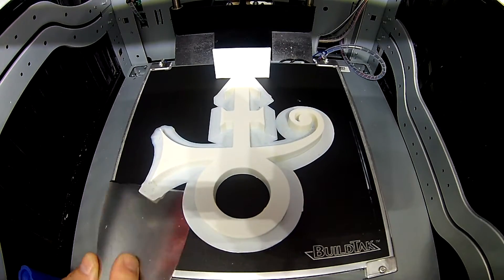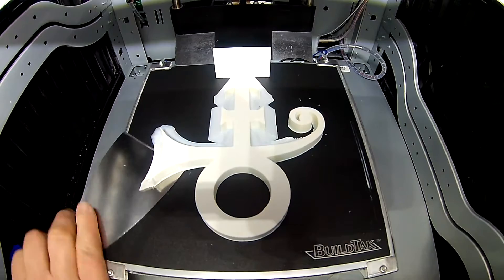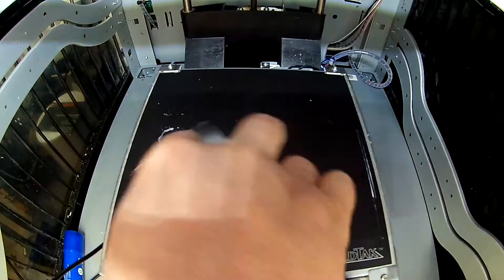It came out very very good — I'd never seen a print stick that much to the print bed. The next morning when the print was done I tried to remove it — that didn't happen easily at all. I learned that when printing on BuildTak you have to raise your nozzle a little bit higher, because if you don't it sticks so well to the print bed that you can even ruin your BuildTak. But when I did get it off, the surface on the bottom side was completely smooth — I've never seen such good quality.